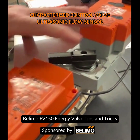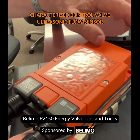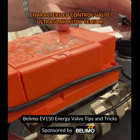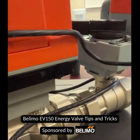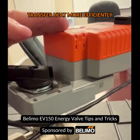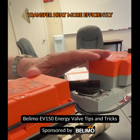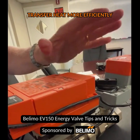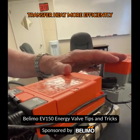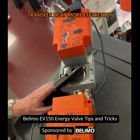With this device, I can expand that to maybe 16 degrees, thereby giving it the ability to dissipate far more heat — giving the fluids, the glycol, the water running through this valve more time to transfer its heat more efficiently, thereby slowing down the pumps and using less water, creating a very high level of system efficiency.